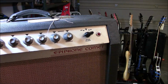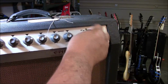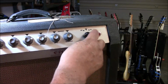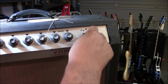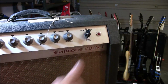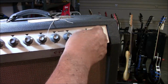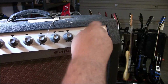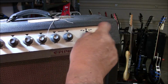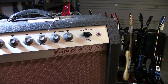But anyway, this thing just spins around, I'm told, so it doesn't work at all, right? Which it doesn't. You can see this, all right? That pot or that switch is totally dead. That's why you can't turn it on. So it's just round and round she goes. Where she stops, nobody knows. Now it could be it's just not on there very well, right? Nope. It's just spinning on the shaft too. The knob's not just spinning, the shaft is too. It's just a dead pot switch. All right, here we go.